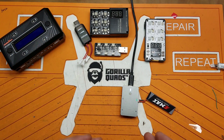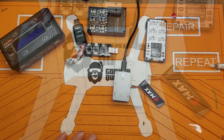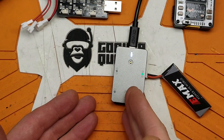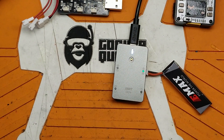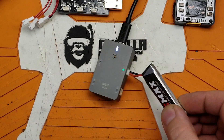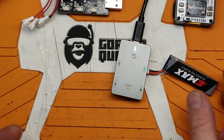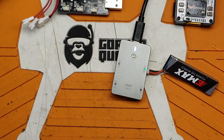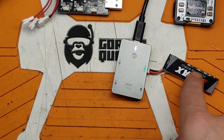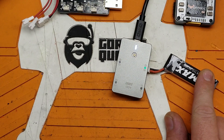The one I really liked but was somewhat disappointed with was the ISDT UC4. The ISDT UC4 runs off USB-C, charges at half an amp, one amp, and one and a half amps — that's huge. It charges four batteries at a time, it's 1S only, and the issue was it only charges at standard voltage: 4.2 volts per cell.